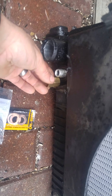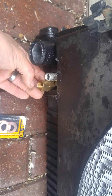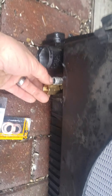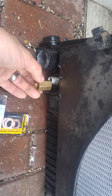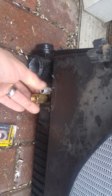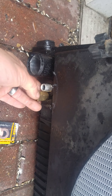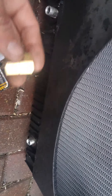I'm going to stick the brass in the aluminum — there's no reaction. This will allow me to screw this on and basically move out the nipple. The connection is going to be further up. I'm going to countersink that nipple inside as well. And that's going to allow me to affix this hose that used to be here to a new brass nipple, which will hold deeper down in those threads that were being used for the nut — but now they're going to be used to hold this down.